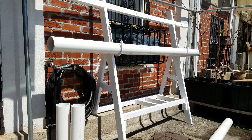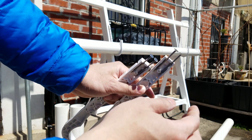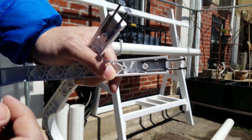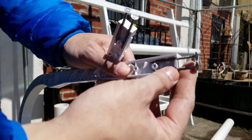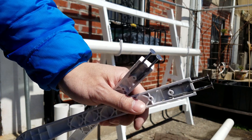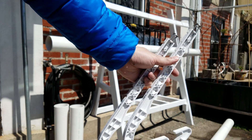As you can see, I'm connecting it through with these J-hooks. The only thing with these J-hooks is that the nails they come with are designed to be interior, so they will rust. I'm just going to use my own nails which are more rust resistant because it's going to be in an outdoor setting. You can find these J-hooks on HomeDepot.com — they're like under $2 each.